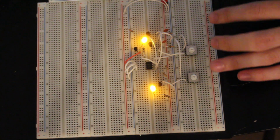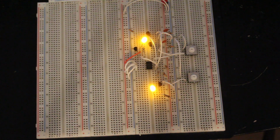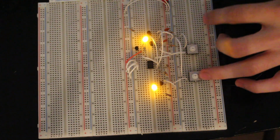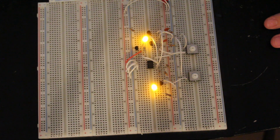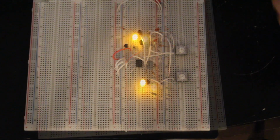This is going to be very painful to watch because this is a 256K memory chip, so that means that the addresses require 2 bytes of data, and then you have the actual data that you want to store, which is a byte. So it's going to be a little heavy to watch this one. So let's get started, and I'll explain how this works as I go.